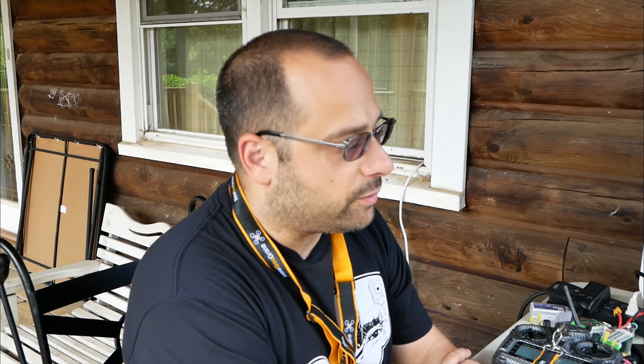As I make these changes, I'm going to want to do some test flights and pay attention to if I start getting hot motors, especially if my props are brand new when I'm tuning. If I then tune to the ragged edge and I break a prop later, I can suddenly smoke a motor, so I want to be careful with that. I always like to do tuning with not the best, brand new props, because it means that when I'm flying on brand new props, the quad will fly great, but if I do get a bent prop or a nicked prop, I'm not going to suddenly smoke a motor.